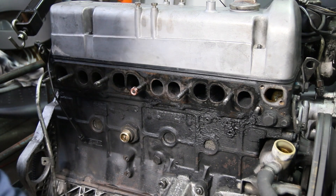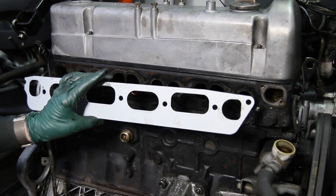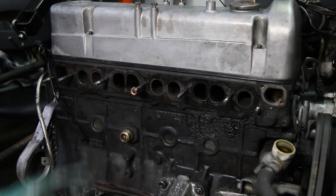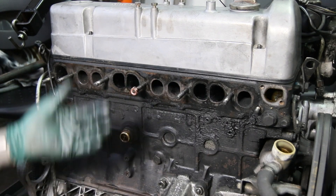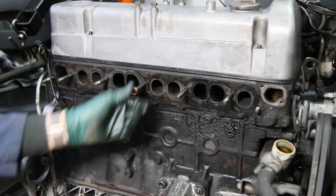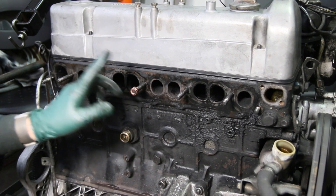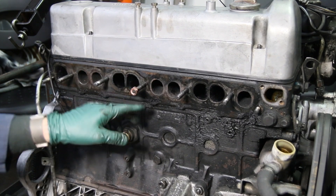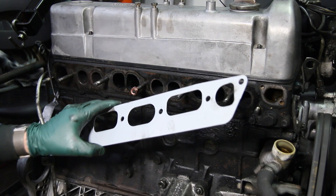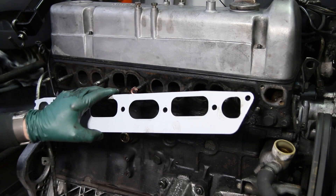Just a little reminder here — think about replacing this gasket. It doesn't get done very often. People don't know it's bad until you pull the manifolds off, just like I did here. And if you're going to replace the gasket, make sure that you replace these locking nuts. I'll put a link below in the description of this video on where you can purchase the gasket and the nuts for the five cylinder diesel engines.